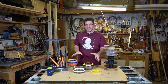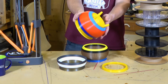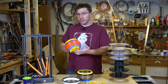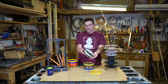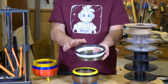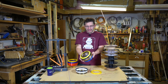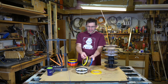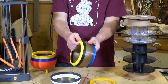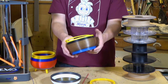Here are the models I was able to print with the Neva during my tests, and you can see I did have some failures — in fact all four would be considered a failure, but I want to talk about this one last. I started out with this one and began inserting different filaments but encountered a clog at the very end. After restarting I got this one, but when it got to the yellow it started to not print very well and you can see the filament itself delaminates easily because there were gaps in the filament.